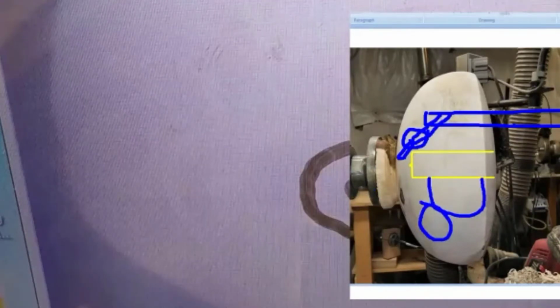So in this situation, I'm way far off the spindle axis. I'm going to get more vibration. This diameter here is only 3/8 of an inch, or 3/16 even, can't remember. So from here to here is relatively prone to vibration. Now, because the Jameson system has that backrest and that big heavy tool with a D shape, I'm not going to get a catch, but I am going to get vibration. So you'll start to see vibration being more of an issue.